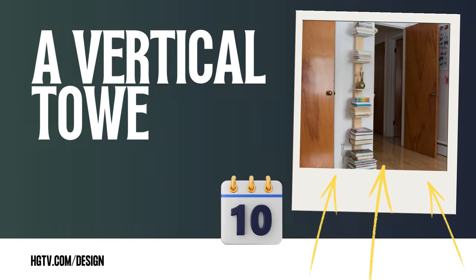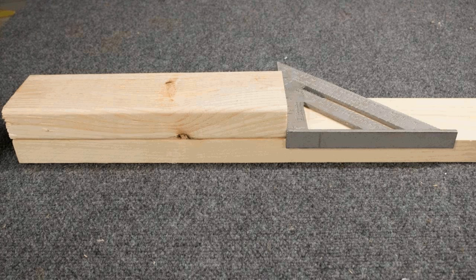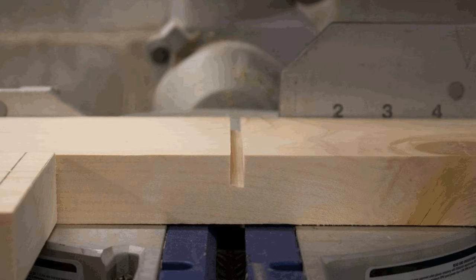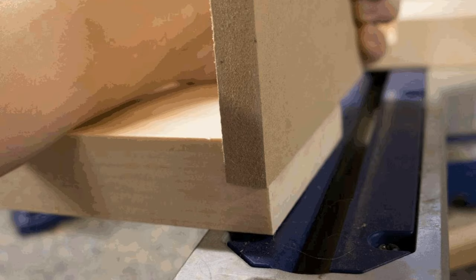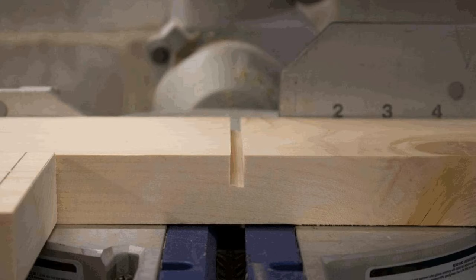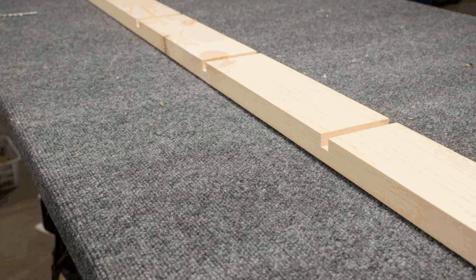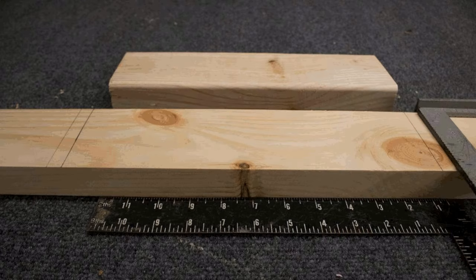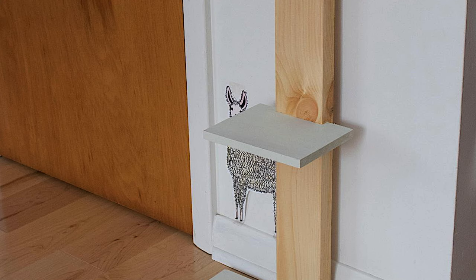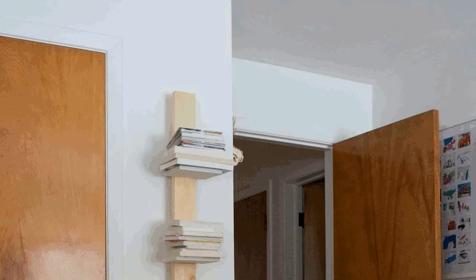Number 10: One more for your books — a vertical tower project. Cut dado trenches into a 2×4 board to create the spine. Measure and mark where each shelf will be located and use a chop saw to make the cuts. Cut MDF shelves to size and wedge them into the trenches before pre-drilling and screwing them in place. Attach the tower base using 4 screws and secure the bookshelf to the wall for safety. With basic woodworking skills and tools, you can build this bookshelf for about $25 in just an afternoon.